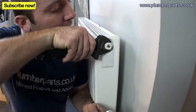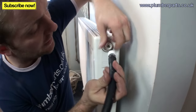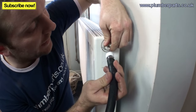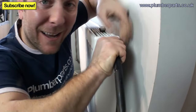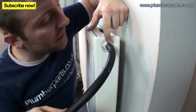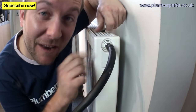After wrapping PTFE, remove your bleed nipple and screw in the hose spigot. Take your hose outside and have it at the ready, then unscrew the valve — it should come quite loose. Have a towel underneath to catch any small amount of water. As soon as it comes out, do a quick changeover and connect the hose. If you don't think you've got a good enough connection between the hose and the spigot, get a jubilee clip and tighten that up.